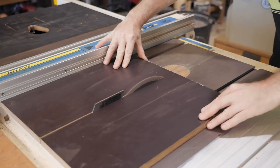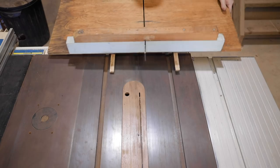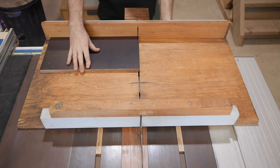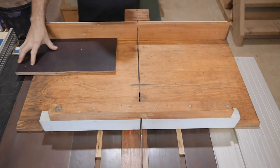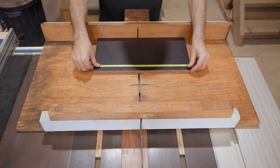You need a piece of 3/4 inch plywood. I'm using form ply but any flat plywood will be fine. It needs to be cross cut square and that needs to be precise. The idea of the guide is to be able to set the mitre gauge quickly but also accurately and reliably. I'm using my cross cut sled for that because I know that will be square.